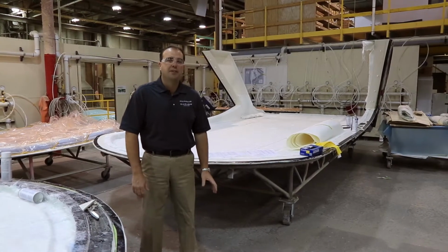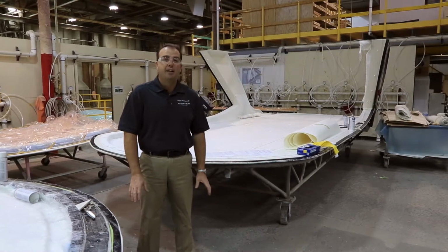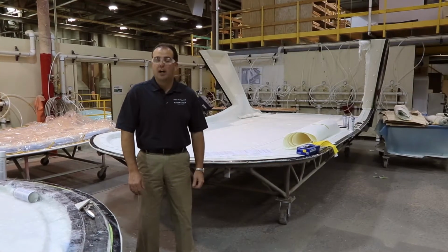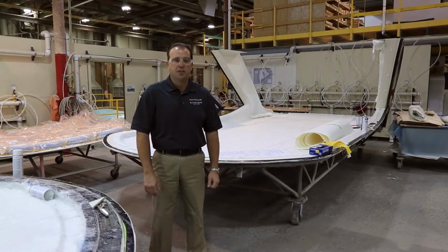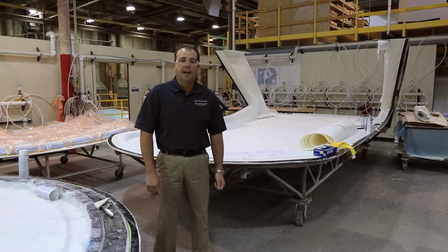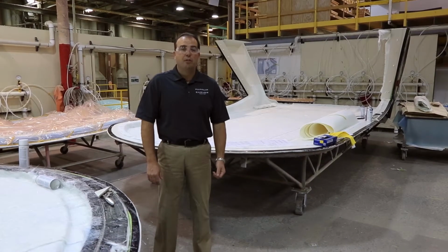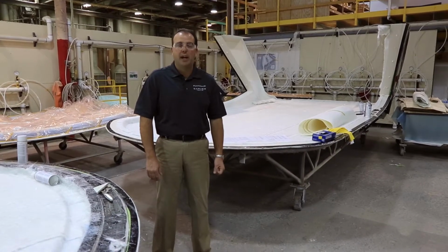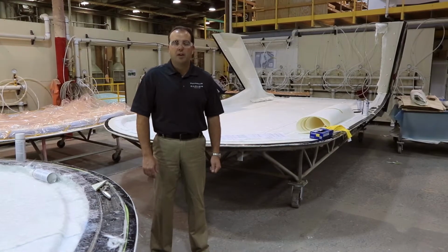With our Carver product, we do a resin infusion process. So we don't do hand-laid fiberglass parts in the Carvers. We have upgraded our technology to do all infusion today in the Carvers. The infusion process gives us a very consistent weight on our product. It makes for a very dense fiberglass part. It reduces the possibility of getting any air voids in there, so you get a nice structurally sound component when the part comes out of the mold.